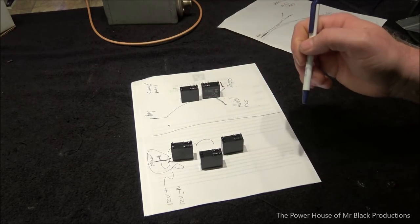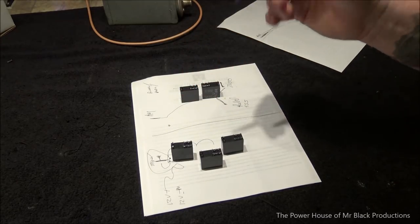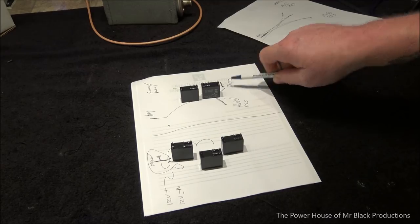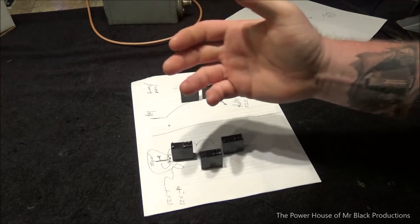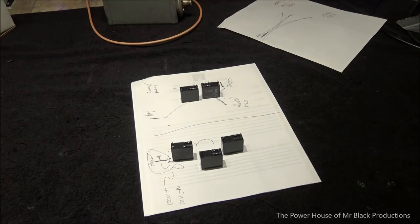That's the reason we need to have this second relay. For the most part, because you could use just a trigger to fire this relay and then fire that relay. But you have to have that time gap to allow the receiver to go into full mute and actually charge itself and take itself into transmit mode. Now, all of this happens that fast. So the relays are going to all go clack to our perception, clack, but there's really not. There's a delay that's involved. So now that you guys got the very basic mechanics of how this works, everybody got that? Okay, let's build it.